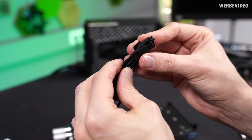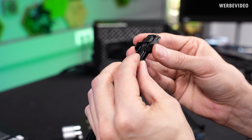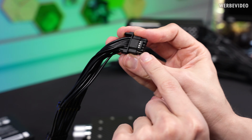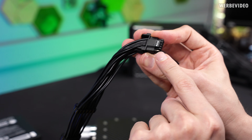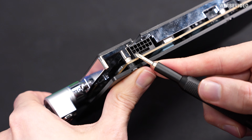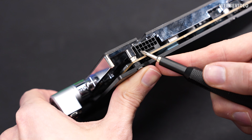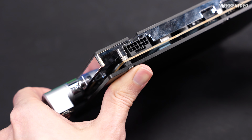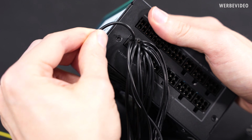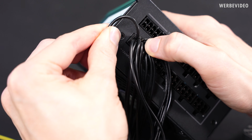Interesting, because it was not one of the center pins, but it was the outside 12-volt pin that partially broke off, but you can also see discoloring on the pin itself right here. And here the opposite side, bottom left, which is this 12-volt pin I was just talking about, you can see some of the remaining plastic still inside that broke off. On the PSU side, it should be this one where I couldn't spot anything, but I could spot it on here, which is actually odd.